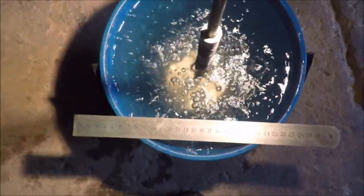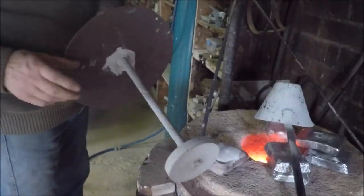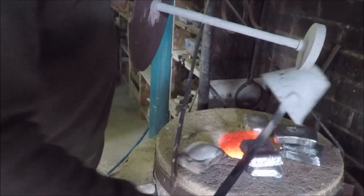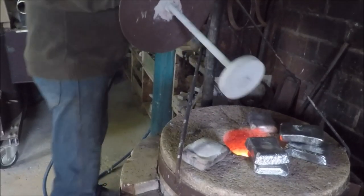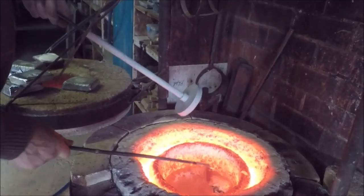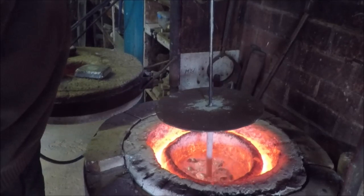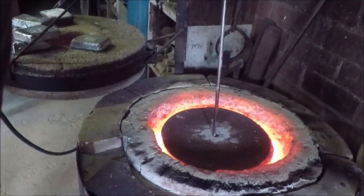Typically I would be degassing my aluminium for around seven minutes. The gas I'm using is commercial welding-grade argon; nitrogen would be just as viable. Now we're about to try the new degassing lance. I've heated it to oxidize the surface, let it cool down, and painted it with the grey boron nitride wash to protect it from attack by the molten metal. I'll turn the gas on at about one and a half litres a minute and clean the rubbish off the top first, then go in and see what happens. The bubbles are very large right now but I suspect as everything warms up they'll come down in size.